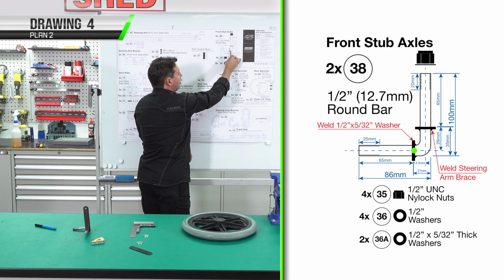We're up to part number 46. It's 38mm tube, 1.6 wall, ERW, electric resistance welded tube, 605mm long. We'll be drilling 2 holes for nutserts at a later stage. Our steering column will be cut at 605mm, then we'll measure 200 and we'll do the hole for our nutsert. The other nutsert will be done when we're actually mounting the steering column to the chassis.